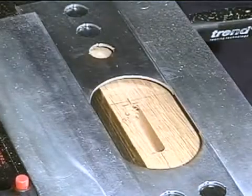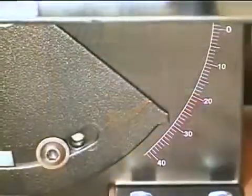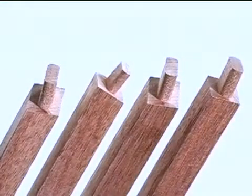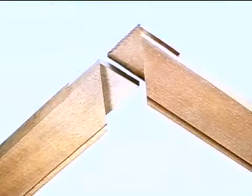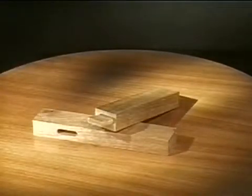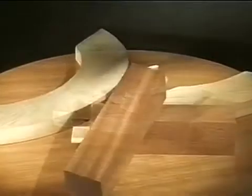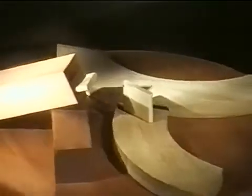process even further. This patented jig is adjustable in both planes, allowing front, side and compounded angled tenons to be cut as easily as square-shouldered tenons. Also haunched or mitered tenons. Stopped or stub mortise and tenons. Side-angled mortise and tenons. Compound mortise and tenons. Slip tenons, useful in antique furniture restoration or when complex joints are required.